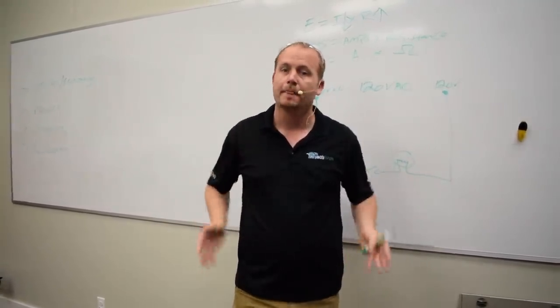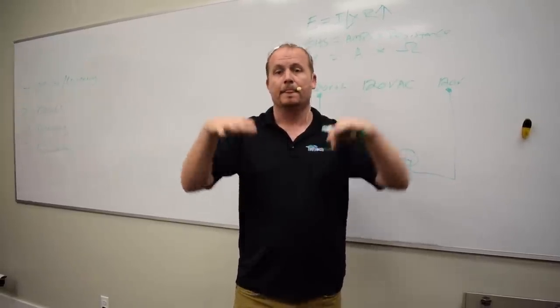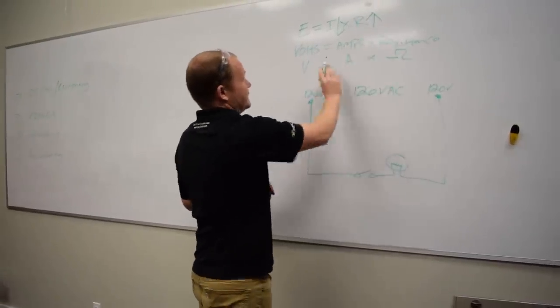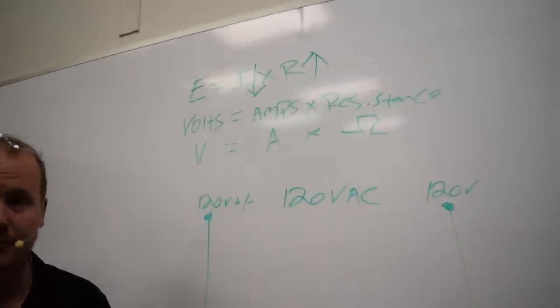That makes sense. So when you have a physical resistance against a motor, the electrical resistance decreases. When the electrical resistance decreases, the amperage goes up. So that's this inverse relationship between amperage and resistance.